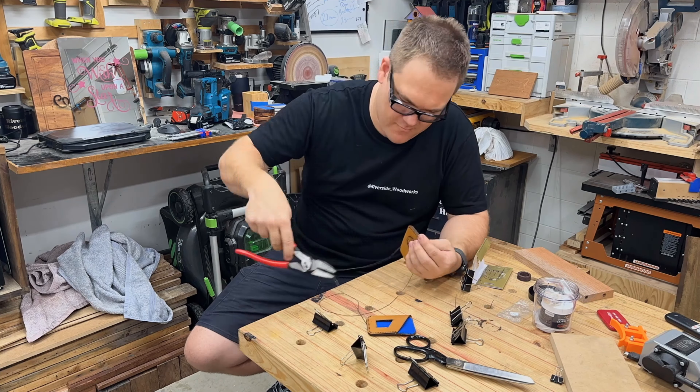Safety is a big factor when it comes to lasers. That's why you'll see me wear my protective glasses and a mask. I also have the industrial fan in my workshop on and my garage door open. My recommendation is that you buy one of these fume extraction tents when you buy your laser. This one is from Creality and it works great. The reason you won't see me use it in this video is it makes filming quite difficult, but once filming is finished the cover goes back on and fumes are extracted out of the garage via the built-in extraction fan.